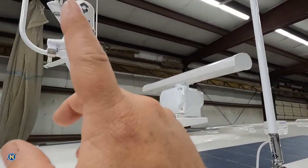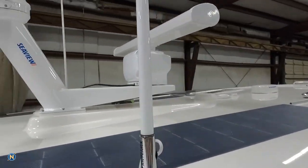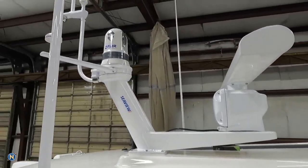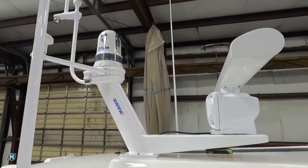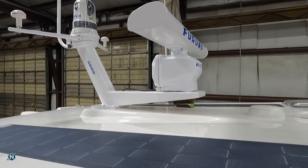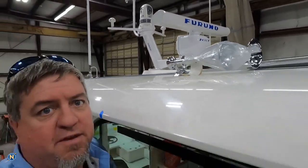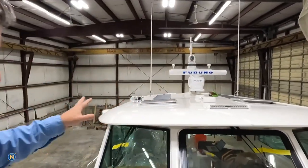On each of the wings we have our GPS antennas. Why are there two GPS antennas? One is for AIS, one is for NAV as a backup to our SAT Compass GPS. Then we have the FLIR M300 camera, our four-foot open array radar pushed forward on that tongue, and you can see the first of two Xantrex solar panels — those keep the batteries topped up a bit.